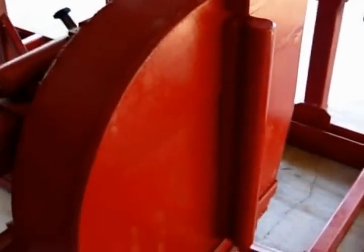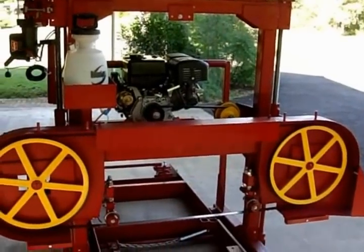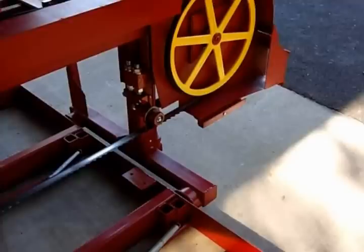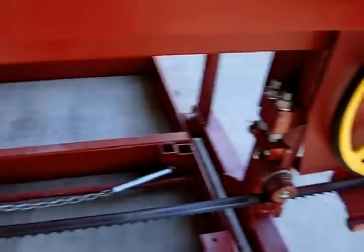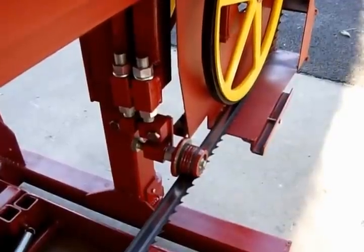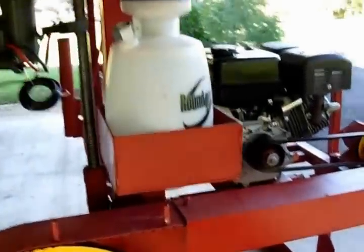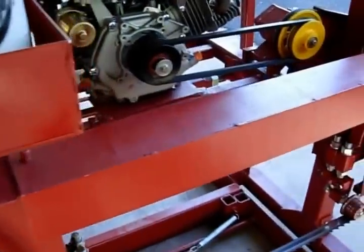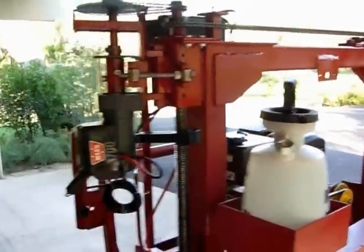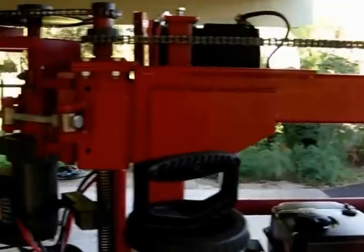Now the front two covers are on. I don't have the pulleys on there yet, but you can see how easy this is. We've almost got our saw together now. I've taken the wood covers off the front and since then I've put the wheels on and put the guides on each side. If you look at the guide here, you can see it has an up and down adjustment - the back bolts are used to adjust the tilt, and then there's a bolt that goes back and forth to line the guide up. The blade is now fully aligned. The water bottle is in - it has a drain at the bottom. Here's a close-up of the intermediary pulley setup. The winch is now hooked up, and you can see the chain drive that drives it goes across the other side. There's an idler over there to adjust it, and that's how we get these acme rods to go up and down.